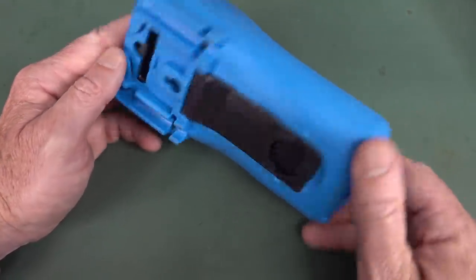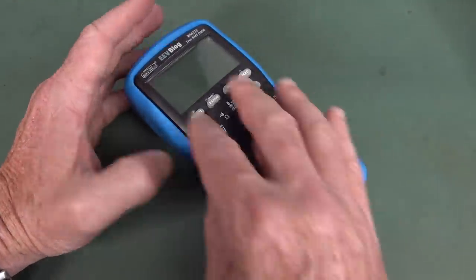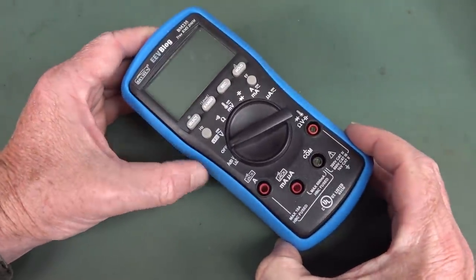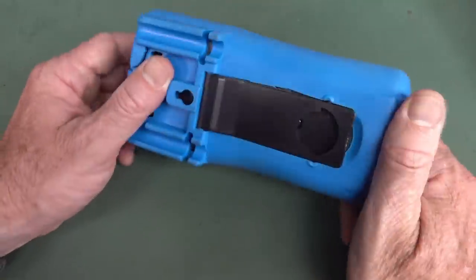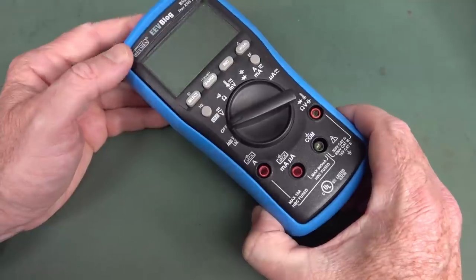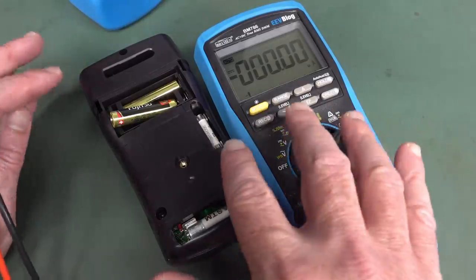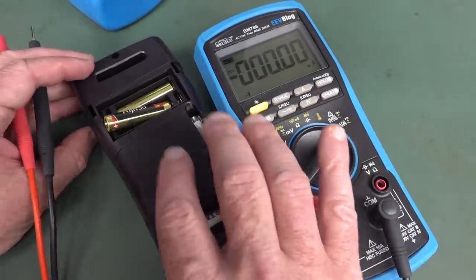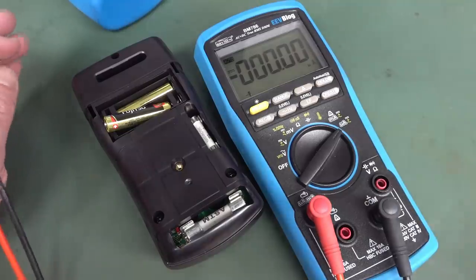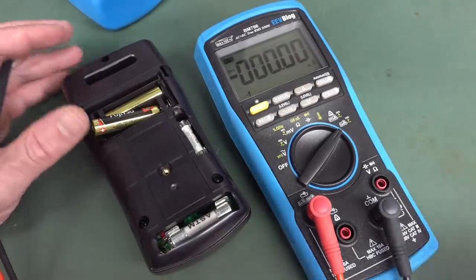It's all secret squirrel. Let's open this up and have a look inside, because I don't remember the architecture of the switch and the battery and any other devices in there that may actually cause a drain. There must be something else in there, like a protection device before the switch, that is chewing some residual power. So let's crack it open. First of all, let's actually measure the residual current of this in the off position. We can do that with the BM786 here because it's got 10 nanoamp resolution.